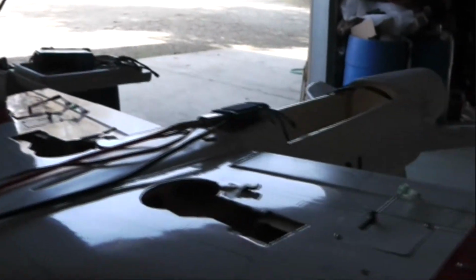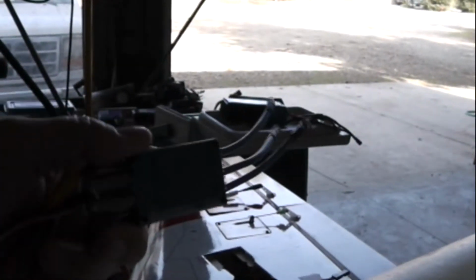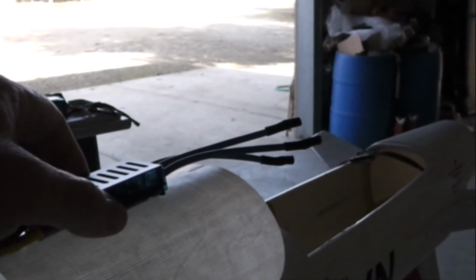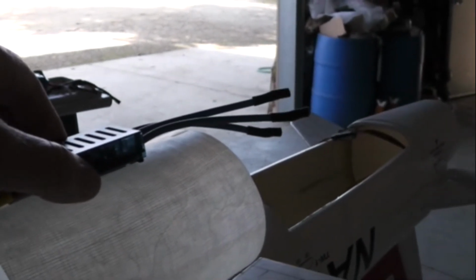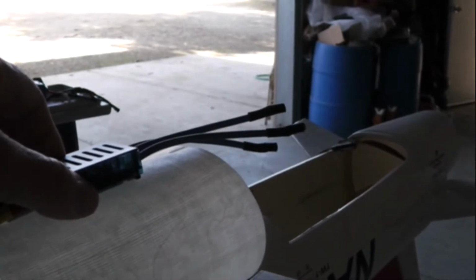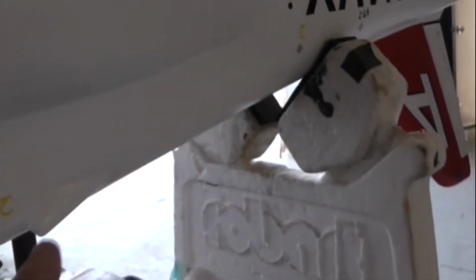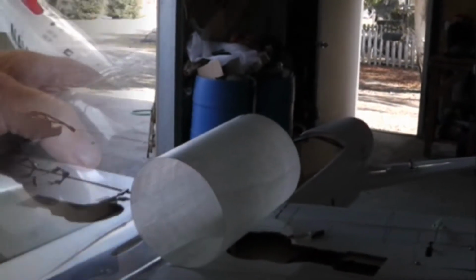Plan to cool the ESC by mounting the cooling fin just inside the intake ductwork in front of the fan. Not enough to really destroy the vortex or the curling of the air coming into the EDF. Just pretty much flush. That way we get superior cooling on the heat sink, and the body cavity will also be cooled through the forward vents here, as well as other places to cool the backside of this. We probably won't be hammering it 24/7 anyway, so I doubt we'll really reach its capabilities, but cooler is better. Alright, we'll see you in a bit when the EDF arrives.